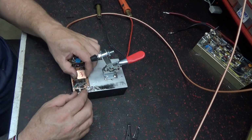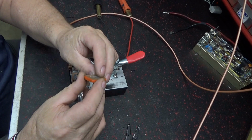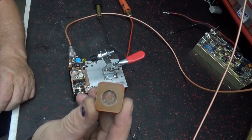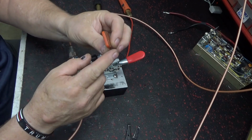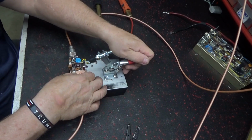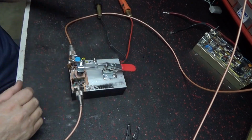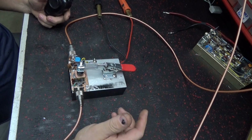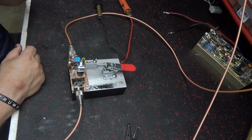So you just put your transistor down and put this little thing in there, and it's got an indentation in it. That's 3 pieces of phenolic put together with double stick tape and glue around the edges of it. So you put that down there. You bring your arm down, you clamp it so it connects all 4 legs like soldering it, but you don't have to solder it. You don't have to screw it down. You just put it in. Alright, and simply turn the power on.